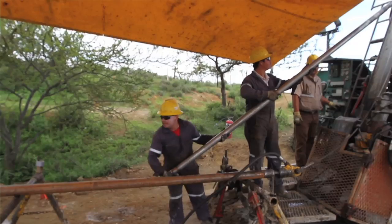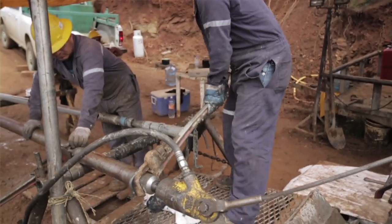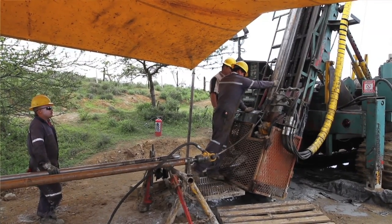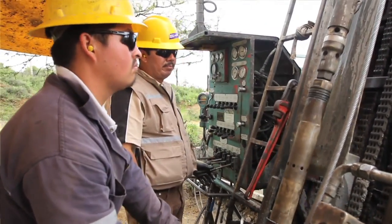As the drill progresses down through the rock, there's a natural tendency for the drill stem not to go completely straight. Because of how a drill bit and stem turn, you actually end up with a corkscrew going down. The deeper you go — and it also depends on the kind of rocks you're going through — that rod system will deviate. The smaller the rods, the more likely they are to bend. Think of this long cylinder of hollow tubes: there's only that little piece down at depth that is actually filled with rock. The rest is still hollow.